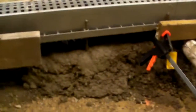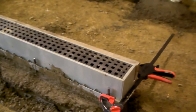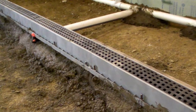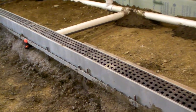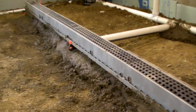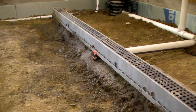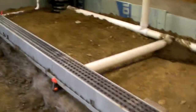I've got two bags of concrete left and all I've got to do is fill in that section here. I feel very good about how tight I have everything down here. What I'll do is leave a small, modest gap between the gravel and the trench drains so that when the concrete does get poured, they'll be able to tap it down there and do that final kind of slush up underneath. But these are going to have hard concrete beneath them — there's no risk of them actually sinking. If I do roll a tote or something filled, an IBC or an apple tote, there's no chance of them crunching or going out of trail. They won't break, but all the effort put into making all the water drain towards the middle will have been lost, and I don't want that.